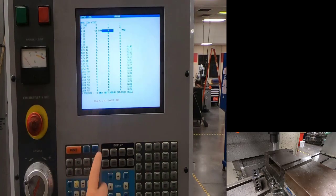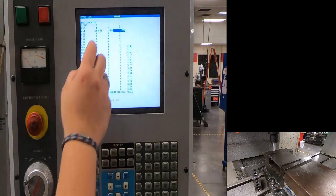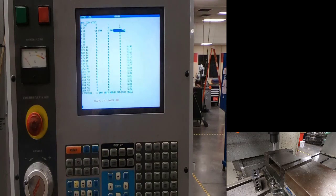If you bring this down close, you can see the middle of the tool is on the edge of the part. Go back to offsets — our machine needs to know that location — and hit part zero set. That puts the machine location in that column. Remember not to hit part zero set on X again because we've already set that. We're done — tools are set and X, Y, Z locations are all set. Hit reset.